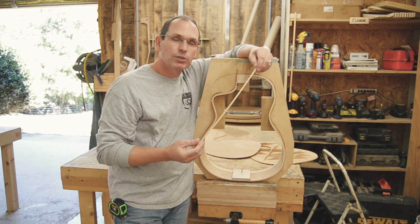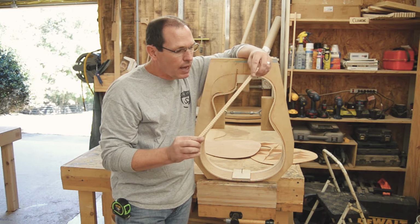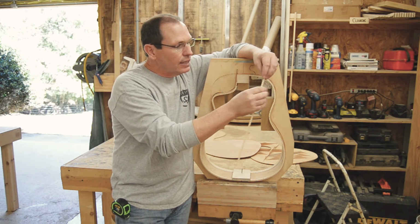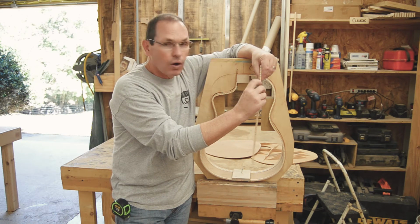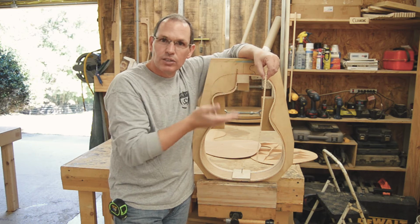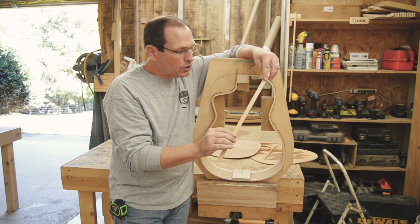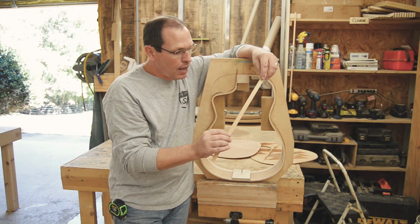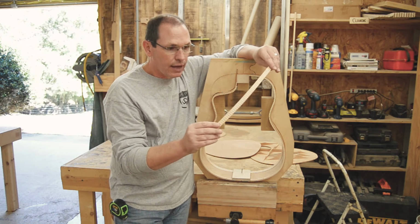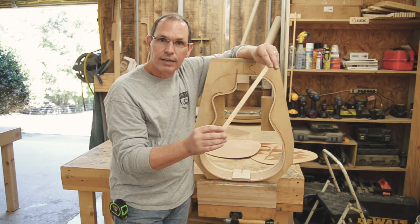This is a piece of basswood. It's a really soft wood, and it's been run through a saw, and it's got these cuts that go almost all the way through the wood. Not quite. They call those kerfs. To cut something is to kerf it. And this is called a kerfed lining. Because it's not cut all the way through, it sticks together, but it also becomes incredibly flexible.